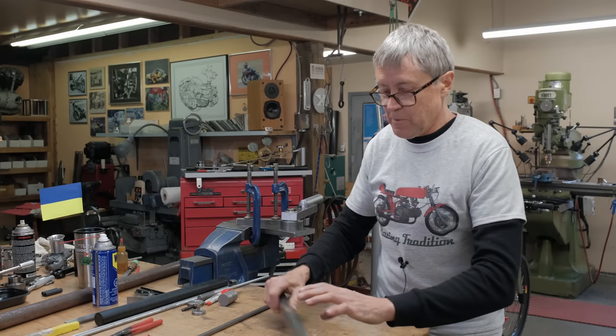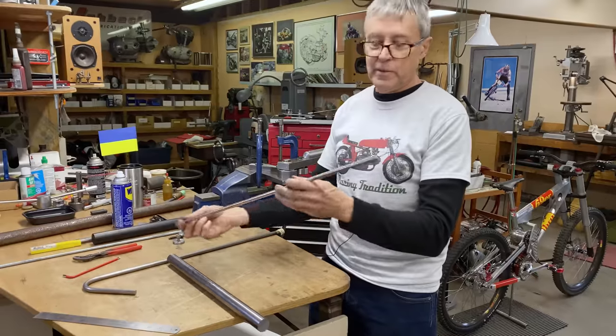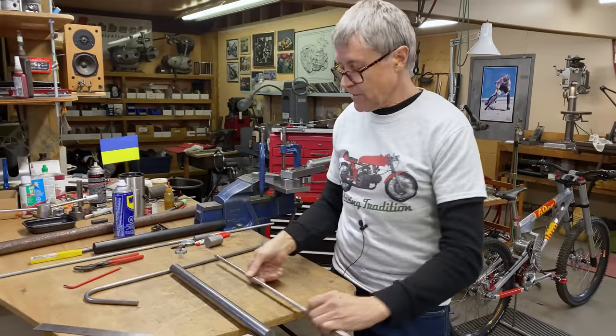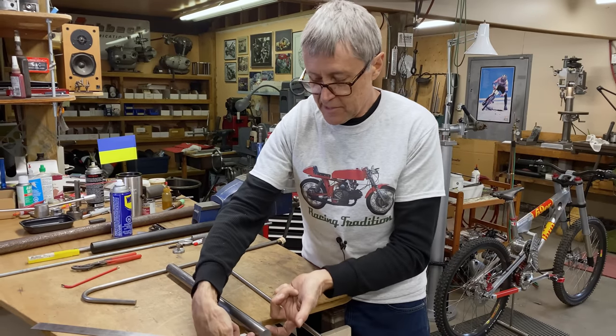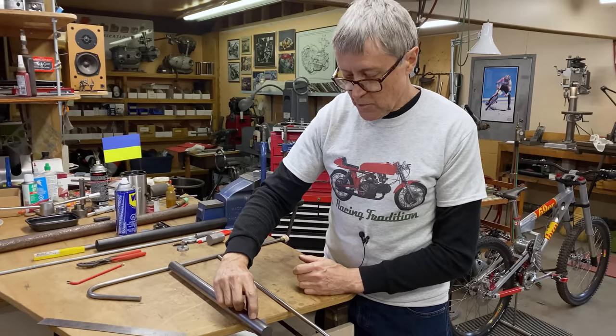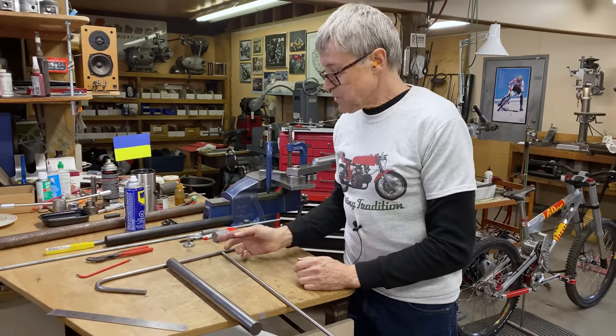So what's going to happen is on the rear axle, there's a hole in the middle. This shaft is going to go inside the axle, and then there's going to be a couple pieces on each side that the stand gets welded onto. So let's hacksaw these. We'll drill holes in the lathe, and then we'll do some bending.